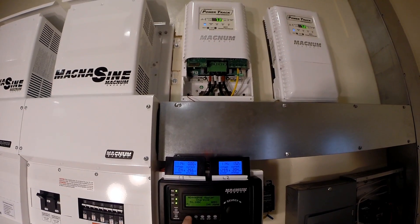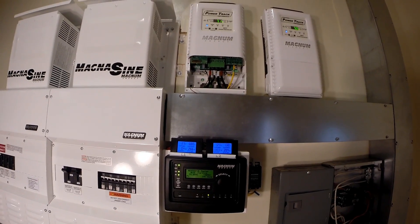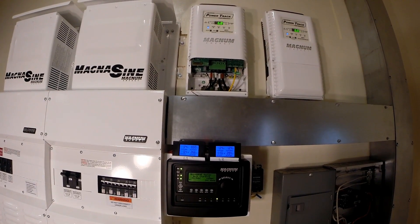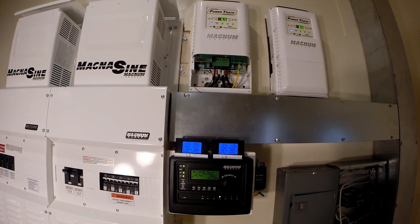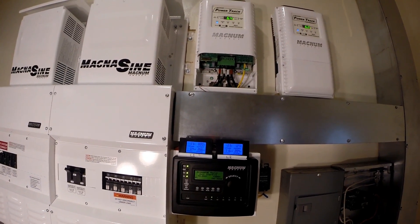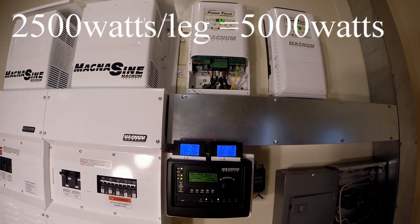How much charging? Oh, charging! There we go — starting to pull some power out of that generator. 40 amps. I hear that generator starting to struggle. 50 amps — it's 50 amps at 53 volts, which is not that much, about 2,500 watts. It should be able to handle that.